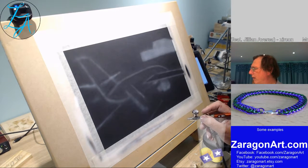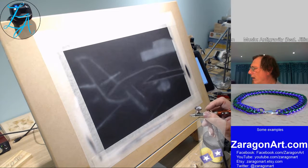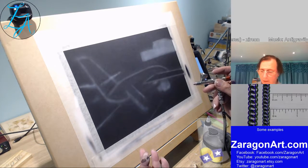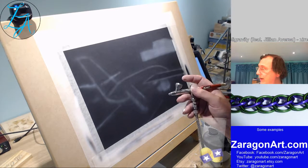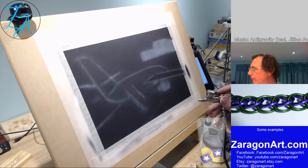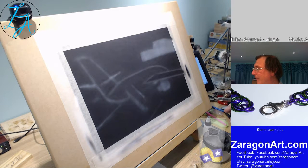And one of those regulators is leaking slightly, because I can see the pressure going up. What should happen is this line should maintain a constant pressure. So when I'm not taking any air, the pressure in this line should not increase. I can see it on the gauge, it very slowly is. But again, that's because these regulators haven't been used for 2 years.